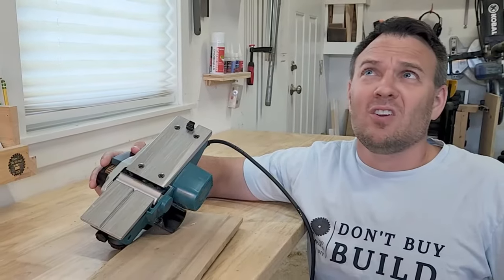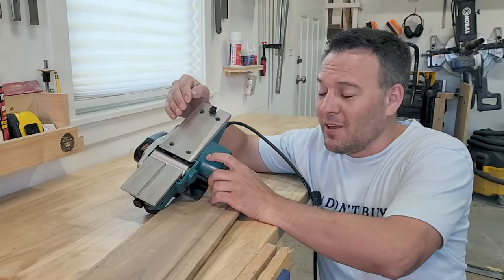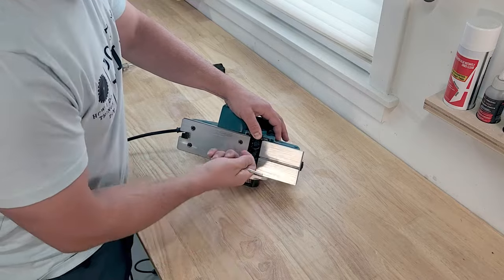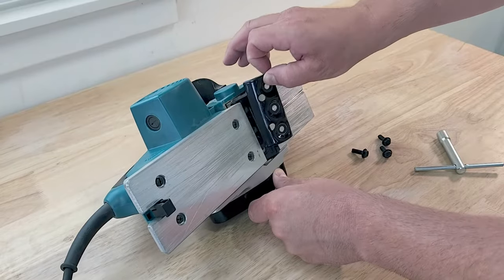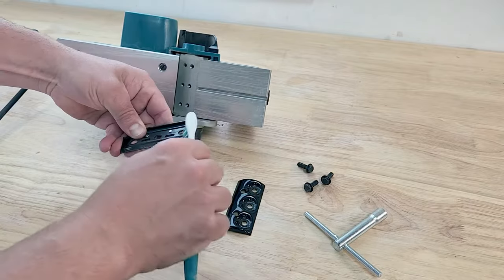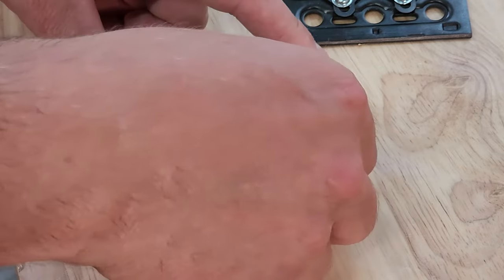But how do I use an electric hand planer? Before you get started, it's always a good idea to check your blades and make sure they're aligned properly. If they're not, it is possible for one side to cut a little lower than the other. To change or adjust the blades in my Makita, I first grab this included wrench and remove these bolts. Then remove the drum cover, set plate, and blade. Be careful because the blades are very sharp. Once you have everything out, this is a good time to clean all the components — I just used an old toothbrush. If your blade is dull, flip it or grab a new blade and set it in the gauge that came with your planer.